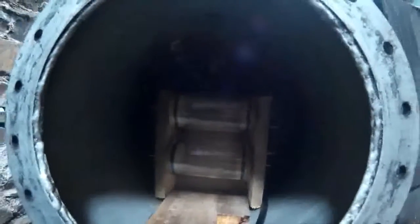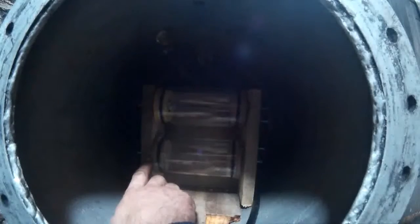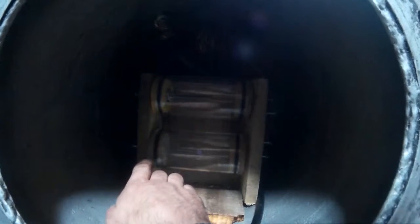Finally get the chance to do another test. On test today we have GRP end caps made in a 3D printed mould. These ones have all been made in a high impact polystyrene mould, dissolved with acetone and with heat, and kind of picked off and peeled.